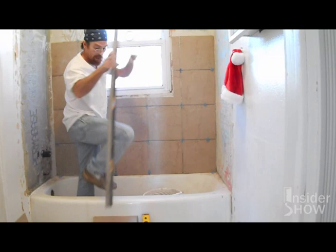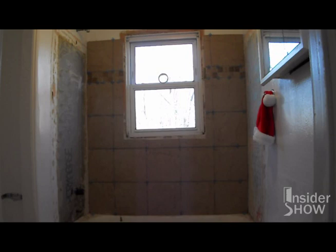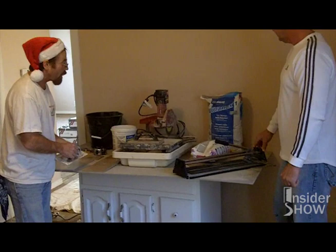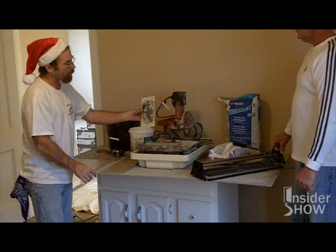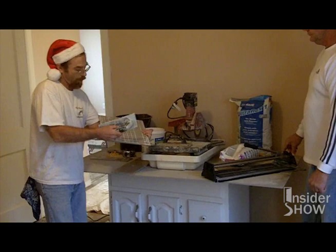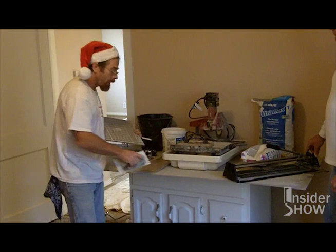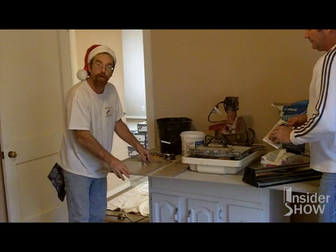I'm about ready to put in the mosaic mortar and I'll cap it off with one more full layer. It's a dry powder mortar — basically a Portland cement-based type of mortar. Mix it up with water; you want to get a consistency kind of like peanut butter. When you go after it with your quarter-inch notch trowel, hold the trowel on your concrete backer board at a 90-degree angle so that you've got a full quarter-inch high ridge that you're troweling on. If you come at an angle, you're not putting enough mortar down — the idea being you get a nice bed of mortar with ridges, and when you set your tile you get good contact across the entire tile.